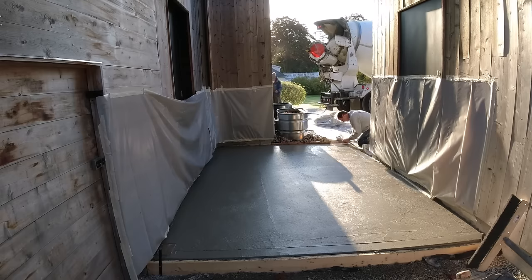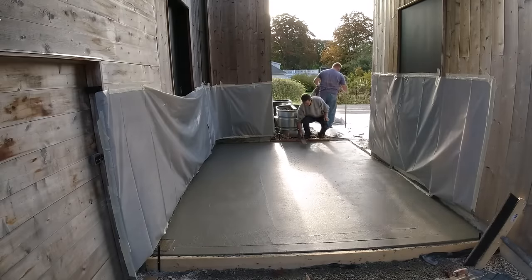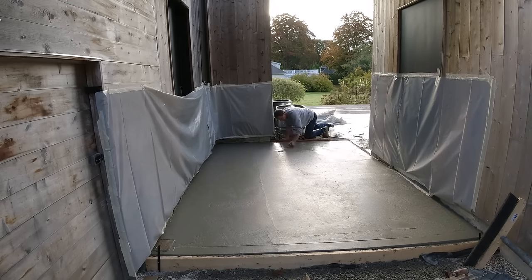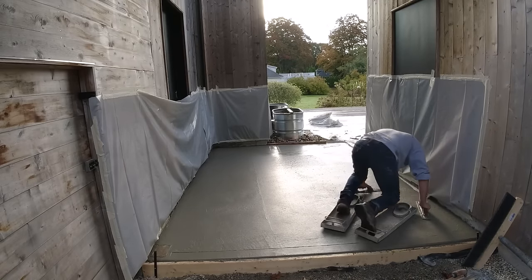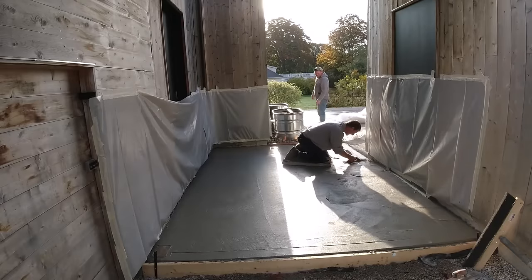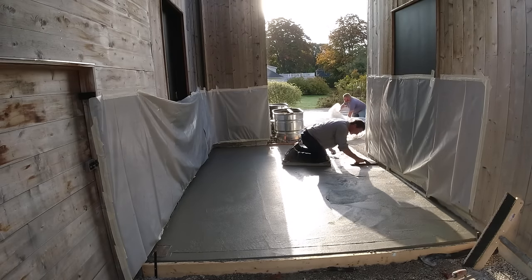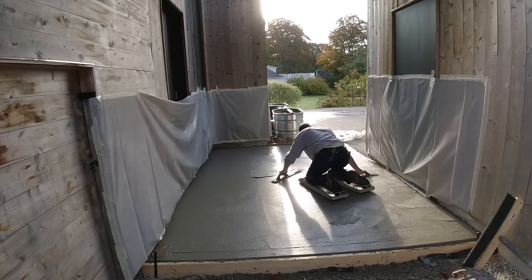The concrete truck really didn't have any time to hang out and wait — it was setting up pretty good on us, which is good, we like that. About 15 to 20 minutes after getting the edges cut in, things are firming up well. I'll just reach out with my mag and get a little on the edge, then put my skids on and really start getting this magged out. I've got to match that doorway — I want the concrete just about flush with the door sill, maybe down an eighth of an inch. The concrete was really creamy; when I push my mag there's paste and cream there to work with.